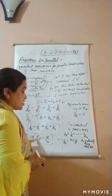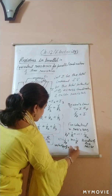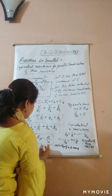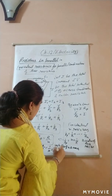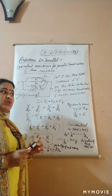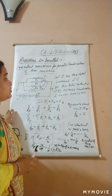For example, 100 bulbs of 10 ohms each combined in parallel: Rp = 10/100 = 0.1 ohm. As you can see, in a parallel combination the total resistance decreases. That is why in our domestic circuits we prefer the parallel combination.